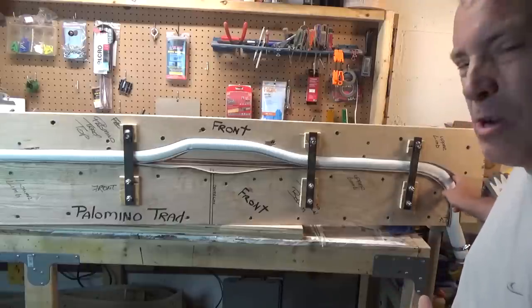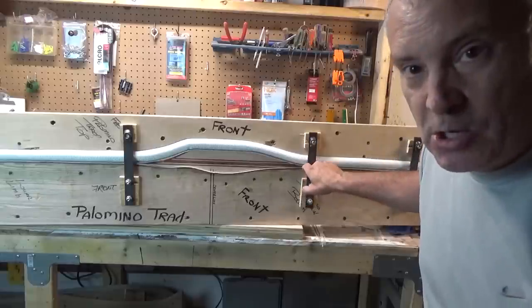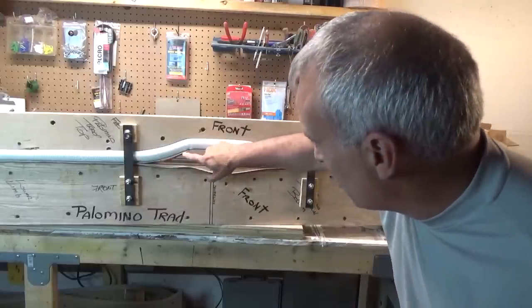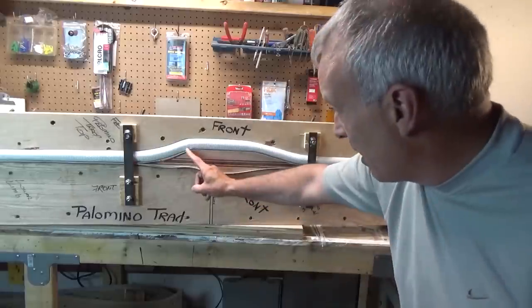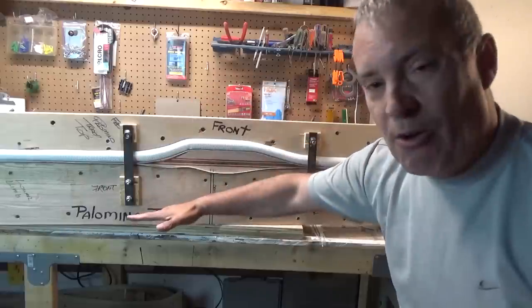And I'm also gonna measure it, and I might make a little block and put a piece of wood in there. The big areas you wanna check is the fades. Make sure the fades are connecting well. And you can see right here it's not. And I was always wondering about this because the sharp edge, I don't think it's going to be able to do it. So what I'm going to probably have to do is cut the mica in that area there, allowing it to bend better.